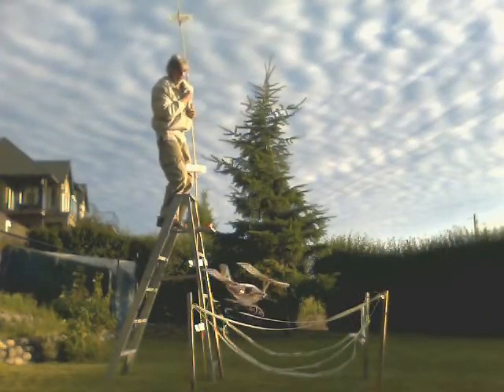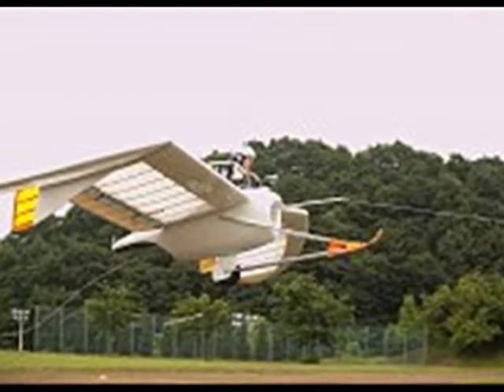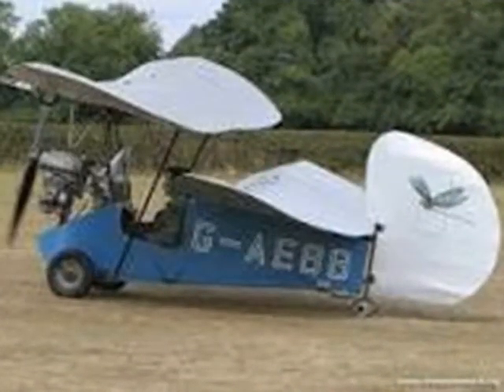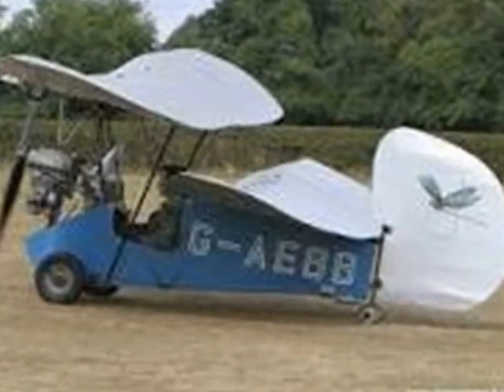Historically, only four or five wings were known that had the desired slow and stable vertical characteristics, so information was sparse. Unlike aircraft having a conventional tail, the Casper Wing's control system allows it to maneuver without forward airspeed. With a shift of his weight, the Casper Wing pilot can transcend the stall realm and enter a controlled mush or vertical descent.